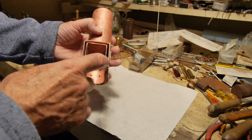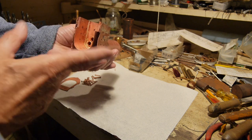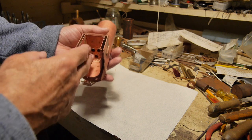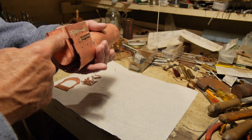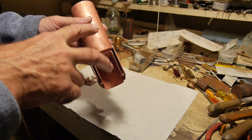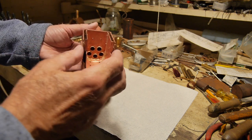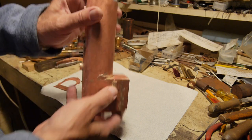I leave the back end open and also leave the foundation ring off, and there are reasons for this. One is so I can get the flame in to heat up the back of the stay heads and get the silver solder on them. The other reason is differential expansion between the two — it avoids putting too much stress on the joints on the outer shell.